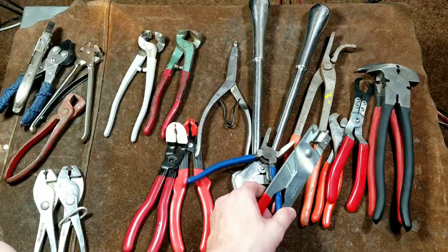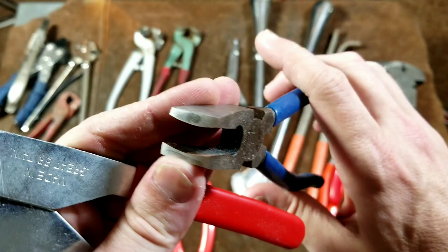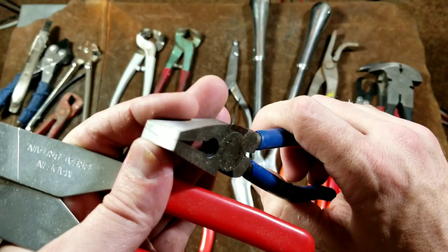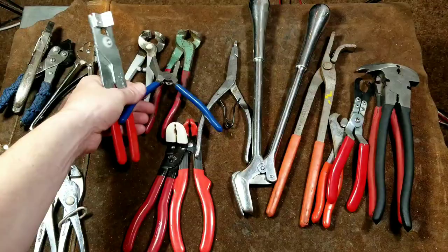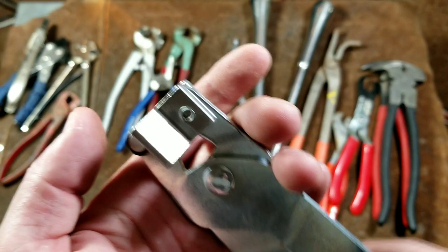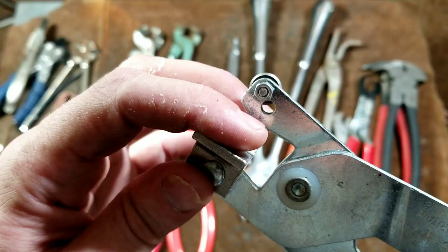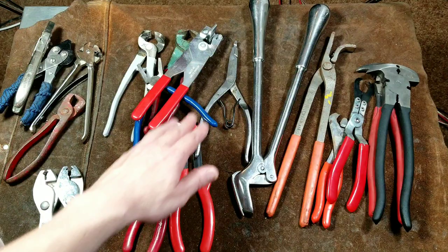Then we have a couple of glass working pliers. Somebody told me that when you fracture a piece of glass you can put these pliers on, apply a little pressure, and it causes the glass to break — it makes sense because they only grab right at the very front and have a really wide gap. We also have a similar integrated unit made in Great Britain with a little carbide wheel on the back to score the glass. You flip it around, grab right along the scored seam, press, and the mechanism goes over center and folds the glass, causing it to fracture. These are glass cutting pliers.